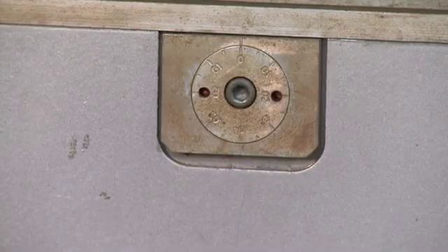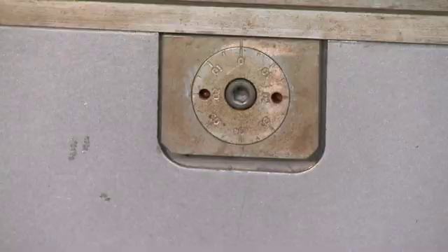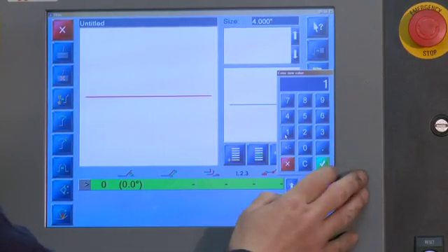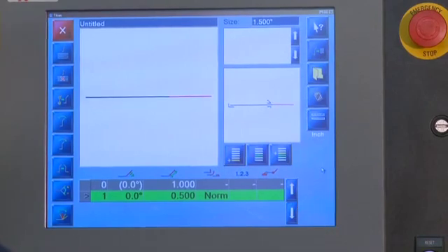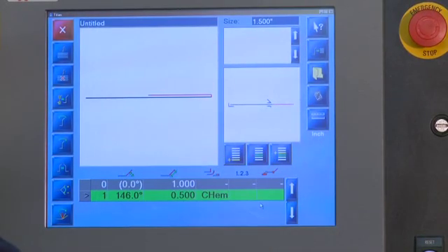The crowning feature allows smooth, consistent parts, whether they be 36 inches or 120 inches. You can simply add bends by touching a button — a calculator screen comes up allowing you to add dimensions. A screen will come up asking you for a closed hem, open hem, or teardrop hem. By simply touching the button, your hem is created.